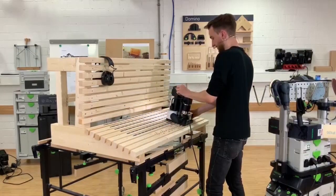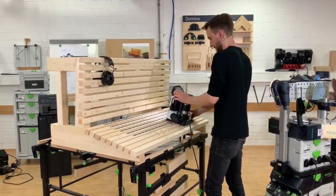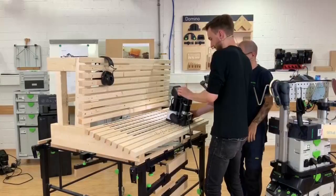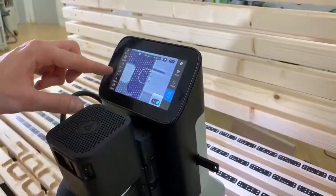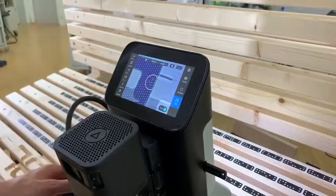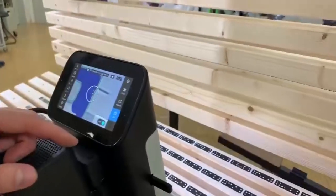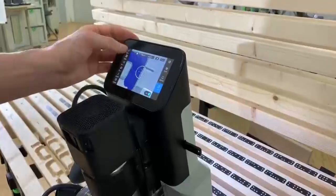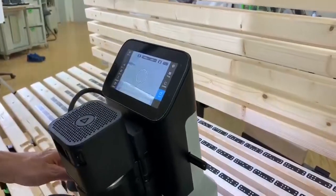So I'm changing my line type from pocket to inside. I'm back with the camera, so I'm showing you one more time. This is the pocket operation I did before. I changed my cutter to 3 millimeters, and now I'm changing the line type from pocket to inside. And this is the remainder that I need to get rid of. We're doing the zero millimeter difference, and then work ourselves out if it's too tight.